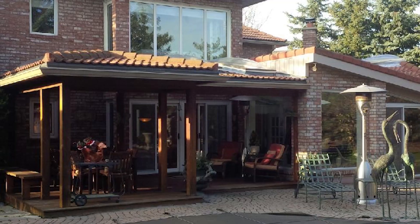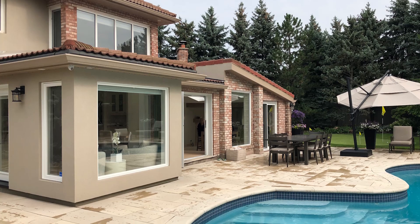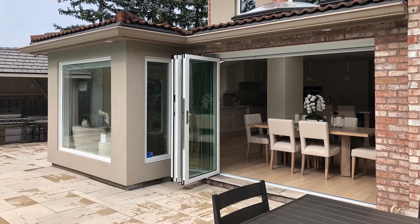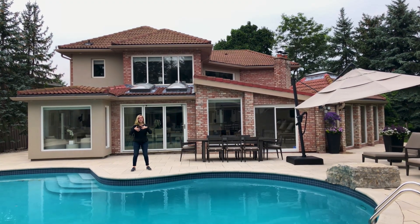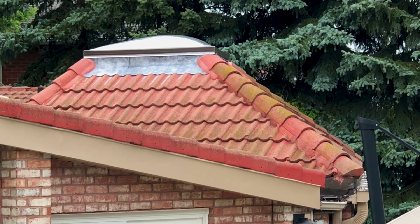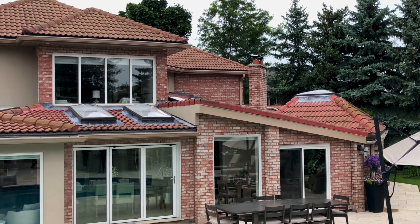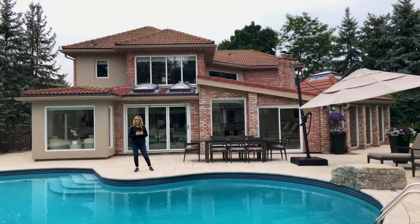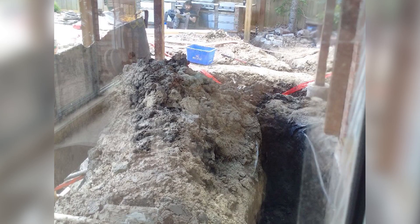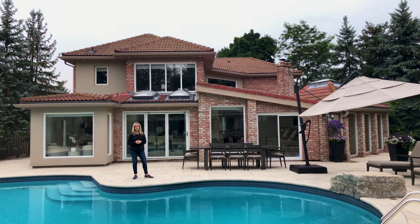One of the things that really motivated exchanging the backyard is this piece here — this was actually just a covered porch, not an enclosure that was part of the kitchen. Once we started enclosing that space and giving us this beautiful view to the backyard, the backyard ended up getting redone. We had to keep the structure as it was and couldn't add two stories because of the roof — it's what looks like a semi-circle tile, made of terracotta, actually called a Marley roof. They're hard to get and hard to repair, so we kept the roof and enclosed underneath it, putting down new footings and foundations.